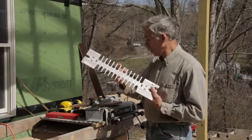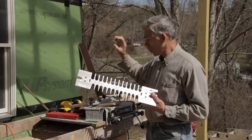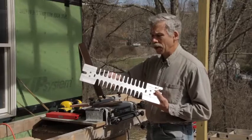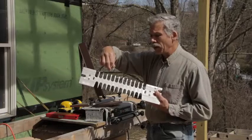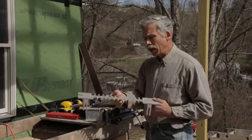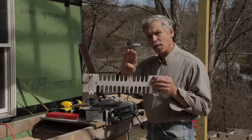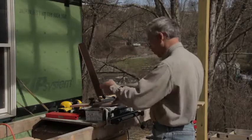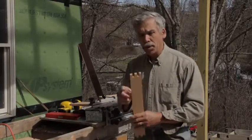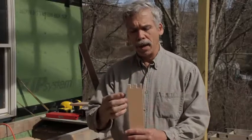Your guide that goes under your router can slide into each one of these slots. When your material comes in from underneath, all of your tails are going to have a slot going straight through your material but it will flare as it goes out to the bottom. All of your pins, on the other hand, cut with a straight bit, will taper from the end of your material. The pins will look like this; the tails will go the other way and they will taper.